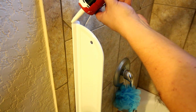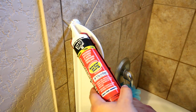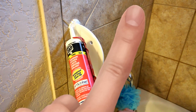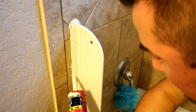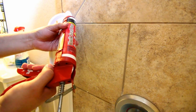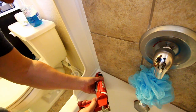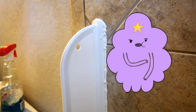I'm going to put a small bead of caulk in here. It doesn't have to go in perfectly the first time. I'm going to apply it all the way down the edge — it's okay if you make a little bit of a mess because you're going to go back in with your finger and clean the seam. Anywhere there's a gap, I'm just going to inject it in there and squeeze it into the gap all the way down. I'm going to put some more caulking along the edge and try to get it into the grout lines all the way down to the tub.